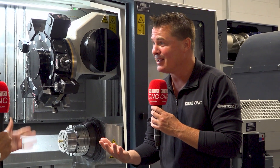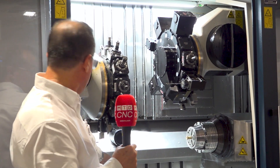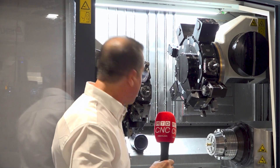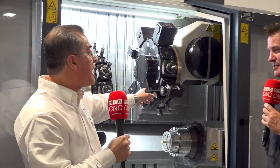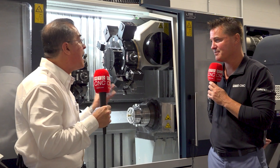You've got a perfect example right here — I've got two turning tools here, one on the lower, one on the upper left, and the upper right has a drill. So I can be turning, doing the pinch turning or the balance cutting, and at the same time I can be drilling the center hole — and that will make us a lot more efficient.